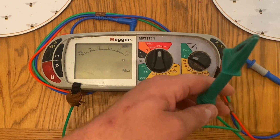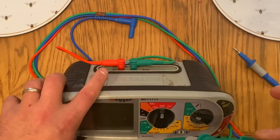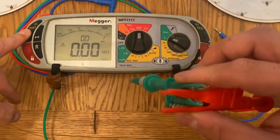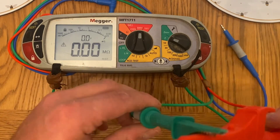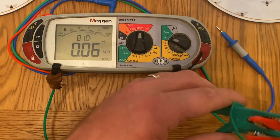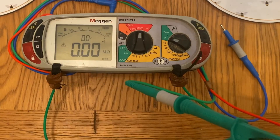Here's a little trick using the crocodile clips. Let's say you've got multiple circuits to test at college or in the workplace. If you link the two leads together — we've got the same leads in and we don't have to change these around for this test — hold the test button and as you can see it gives us a value of zero, meaning we've almost got a short circuit. If we hold that test button and press the lock button, that's going to free up our hand, because to undertake this test we must press the test button. Now we've locked it in — once we release these leads you'll see the reading will go off the scale, showing we've got no conductors potentially touching each other. If we put it back together, we can see it's gone to zero, meaning the two conductors we're testing between are actually touching each other somewhere in the circuit.